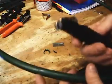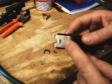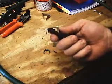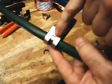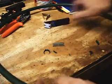So the tool does work, but like I said, usually you only have it adjusted for one side. So I'd say adjust it for the size you trim the most, and keep it out of people's hands that don't know how to use it. It slides up and then it goes straight onto the belt. And be sure to split your seam right down it and hold your pressure as you're rotating it. Alright, that's a repaired green round belt.